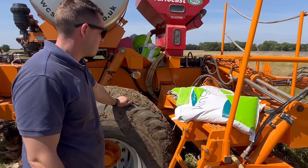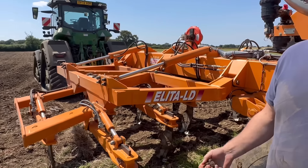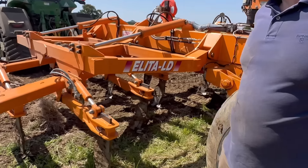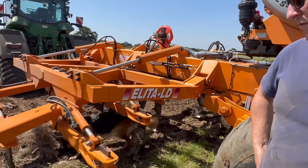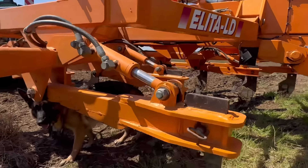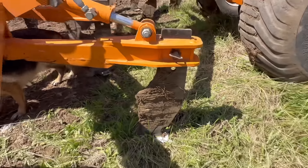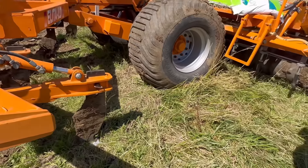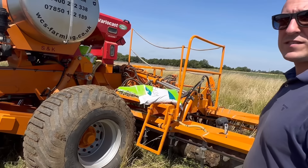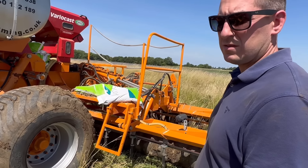What speed are you managing? Because it looks like it's taking some pulling. About 5-6 km/h in the stuff, but obviously in the wetter, heavier bits it's taken a bit much. How many legs are there? 11 legs. They're taking some pulling. And you can see the telltale sign — there's a lot of soil stuck on the outside, not shiny at all. So great — and then what we're doing is we're going to press them afterwards at a slight angle, just to cover and firm. Yeah, we'll see what happens.